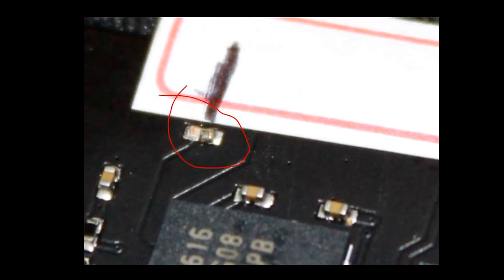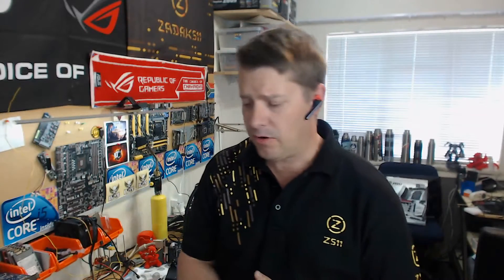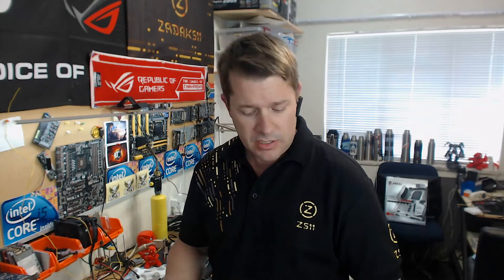The plan is to use a hot air gun to remove the damaged components, then measure on another DIMM that still has those components in place to see their value. Hopefully from there I'll be able to find matching components from other memory sticks that are no longer any good to me. I've got a whole stack of memory in this room ranging from DDR1 all the way up to DDR4, so I'm going to Frankenstein it all up and get it to work. Let's get on with it.